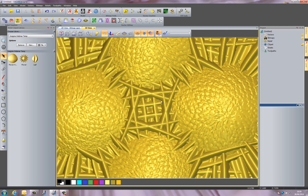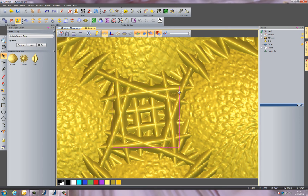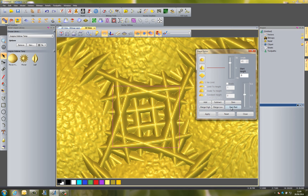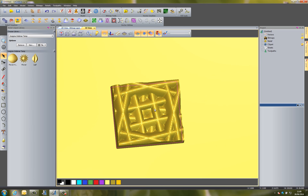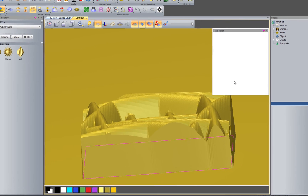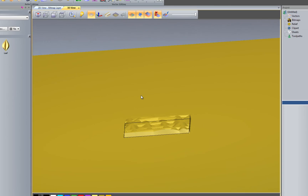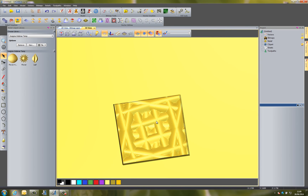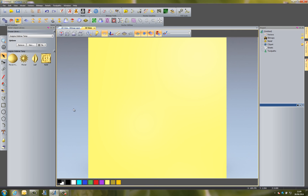I'll paste that down and you can see all of this weaving pattern in the center. I quite like that, so I'm going to cut it out by creating a rectangle around the area, then double-clicking on it to open the Shape Editor and using Zero Rest to cut just that section out. The relief is quite large, so I'll scale it down — let's bring it down to 2.5 millimeters and apply. I can then send that back to the relief clip art library and reset.